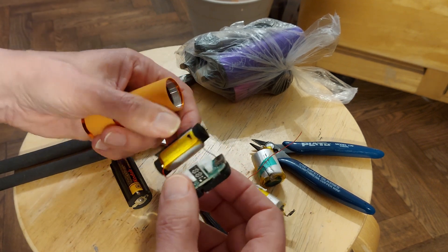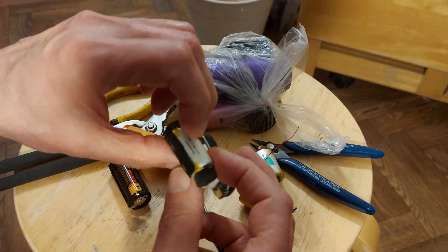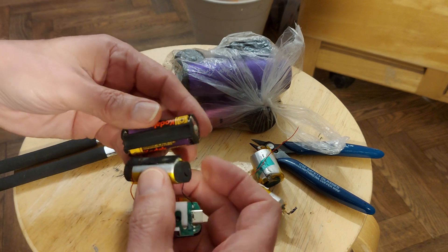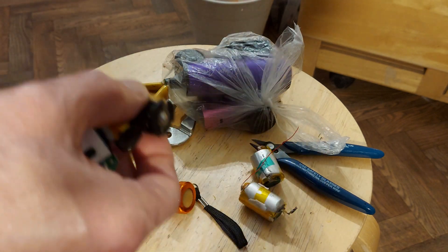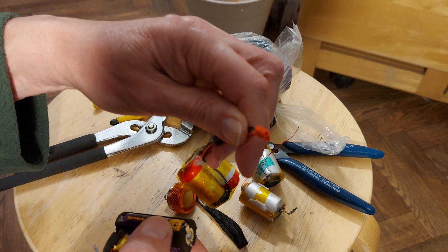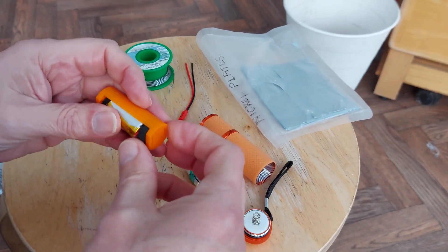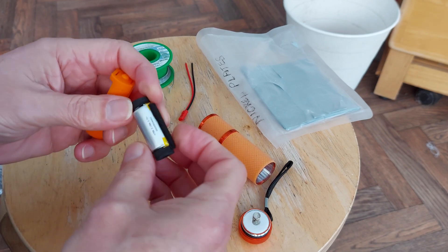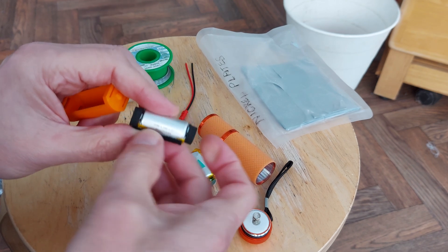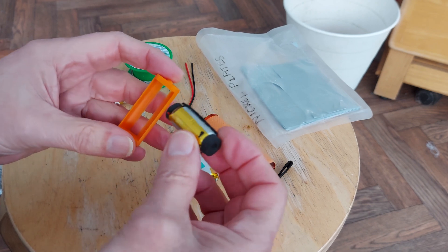So if I use the battery out of the Hayati Ultra, that's quite a bit smaller. That will fit in there with no trouble. So I can make a 3D printed frame to fit that inside. And if I put a connector like that on it, I can plug that into my LiPo charger. I've 3D printed a little case for this LiPo battery to fit into, which is a 17-350 — so 17 millimeters diameter, 35 millimeters long. We've still got the bits of foam on the end of it from where it was in the vape. That will fit in there.